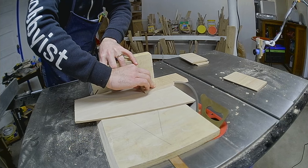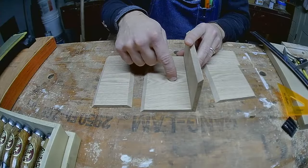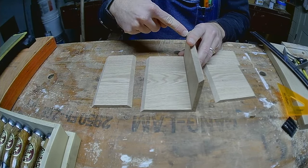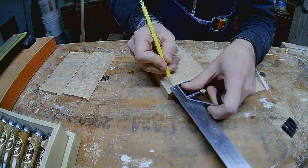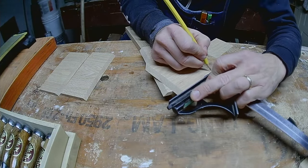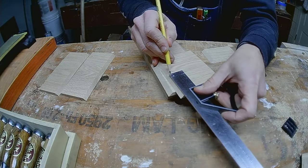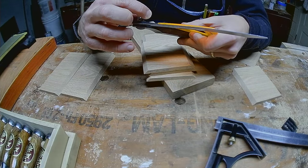The front panel has the same sort of opening cutoff as the box joint tower. I want the dice to tumble side to side before being ejected out the front, so I'll plan to install some ramps to bounce the dice around. The side-to-side ramps will sit at 30 degrees off horizontal.